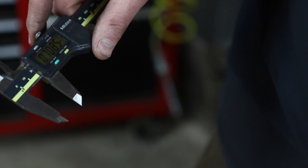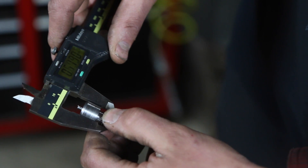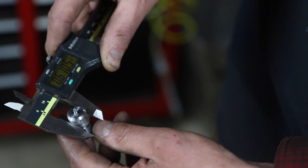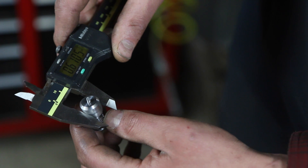So we just went to lunch and I realized I forgot to measure the lathe part. So the part we just turned — set of calipers. We should be at 0.610. Look at that — 0.6105. Five tenths over. Works for me, folks. Take care, enjoy, see you next week.